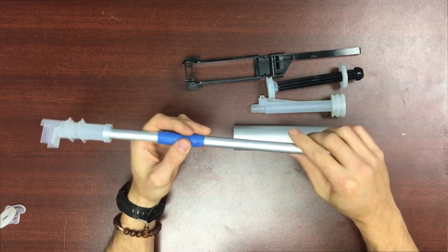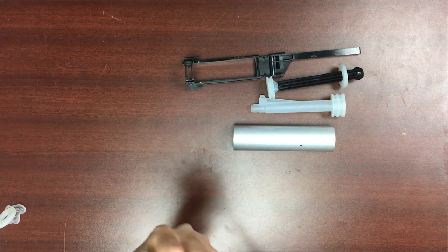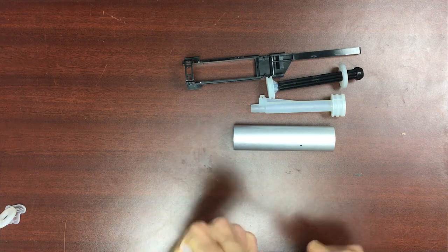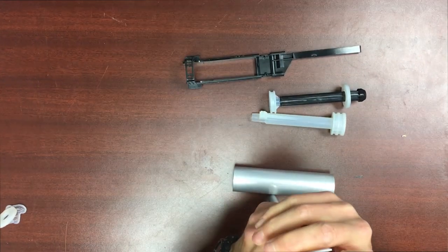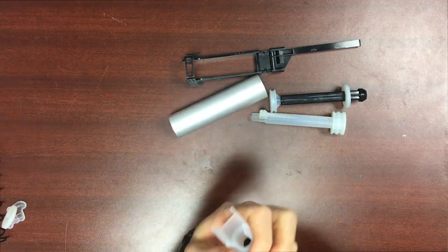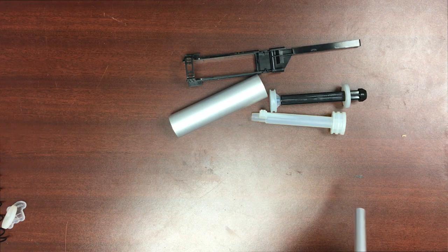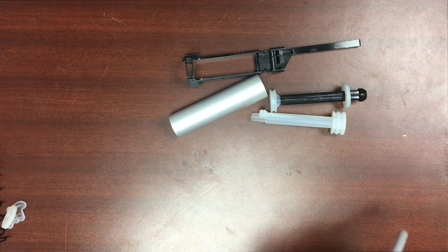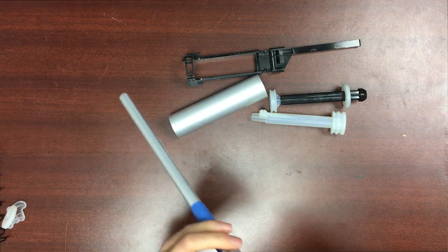On a sharp breech you'll notice it shaving bits of plastic off of the 3D printed part, but with a sanded, polished breech — nothing, it's good to go. You can always throw on some lubrication there as well if you desire. Moving forward, we're going to take the chamber and the barrel — this is a 12 inch barrel and it should achieve velocities around 220 to 250.